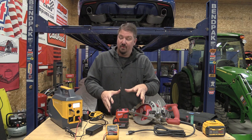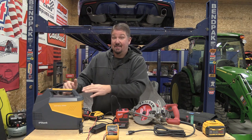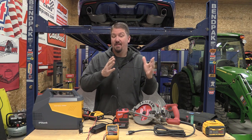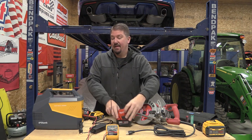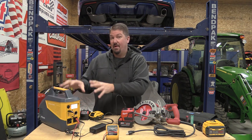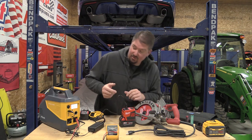At this point I have this plugged into this unit — this is just a battery inverter, 635 watt-hours. Watt-hours is just voltage times amp-hours. So this is a 90 watt-hour battery pack that is charging — not completely, but it's charging — a 635 watt-hour inverter. The reason it's able to do that is because this is only a one-amp pull on 120 volts. It won't last that long, but it works because it's only one amp.